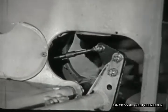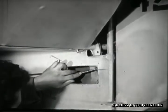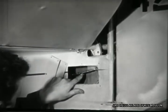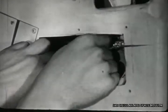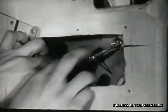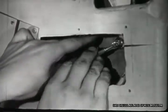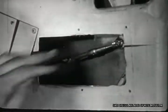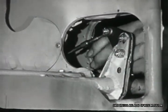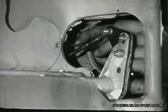When you're sure the number of threads showing will be within regulations, you can let out the lower turnbuckle a couple of turns. If you don't have a regular turnbuckle wrench, almost any kind of pin through the barrel makes a good one. When you shorten the upper cable, you take the turnbuckle in the same number of turns you let out on the lower one to keep the tension balanced.